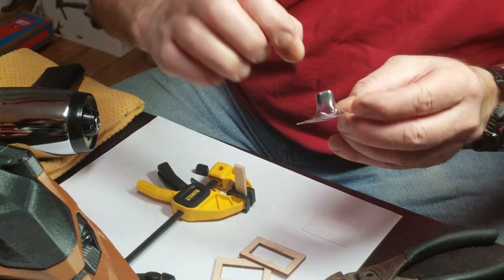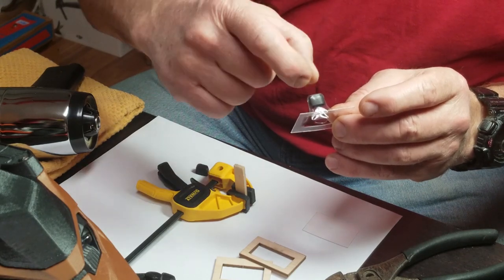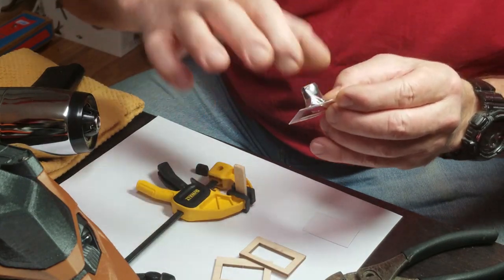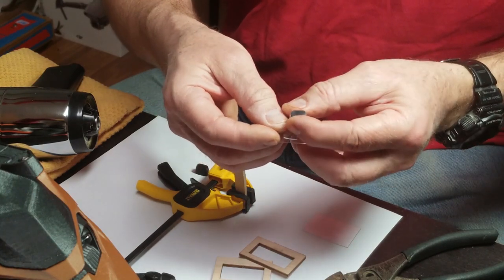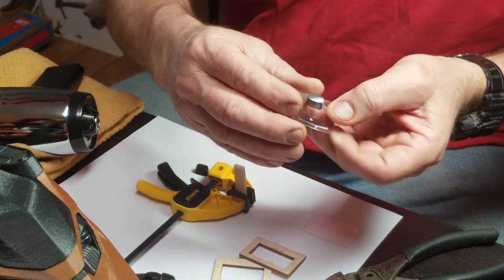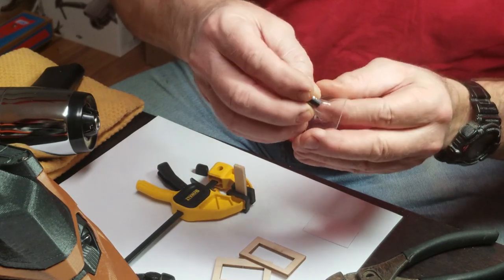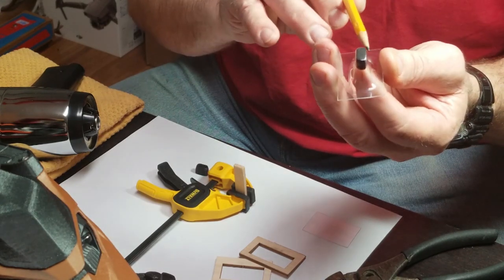The other thing I did is I increased the length — I made it 343 thousandths long. That's the Z measurement in Prusa Slicer. It just gives a longer distance — I'm not sure of the right term for it in molding, but like a longer flow, a longer distance to pull it over straight. Because it's not vacuum molded, it's slightly pulled out.